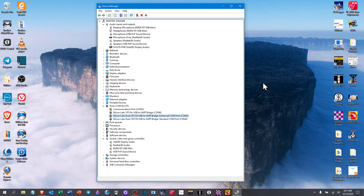When using the Yaesu FT-891 with the DigiRig or another third-party sound card, you'll get a different look in Device Manager. Under Sound, Video, and Game Controllers, you'll see USB Plug-and-Play Sound Device — that's what you'd expect. You'll also see two com ports pop up when you turn on your rig. Which one do you use? Start with the Enhanced versus the Standard — that's the one that always works for me on multiple computers. So COM5 is my Yaesu FT-891 in this case.